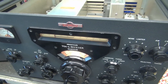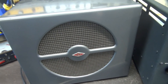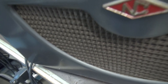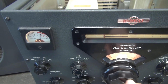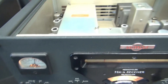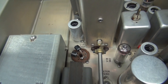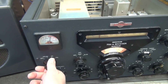The receiver is warmed up. Let's see if I can pick up any stations or detect any hum from bad caps. I've connected my National 183 speaker with the volume all the way down. There is some low-level hum, but the receiver is operating, which is a good thing. My guess is the hum would be because the filter cap is leaky, and those diodes can induce some hum because the high voltage has changed. I do not recommend putting in rectifiers in place of your tube — you should always leave it stock.